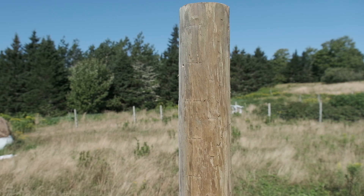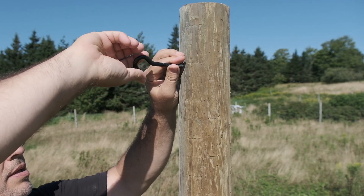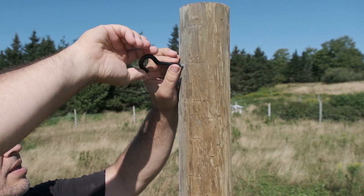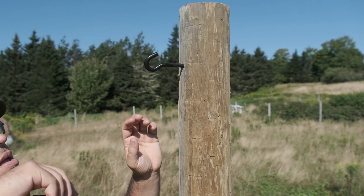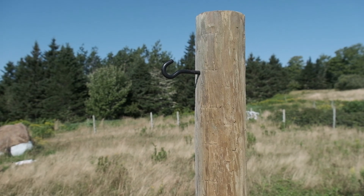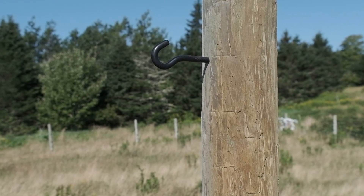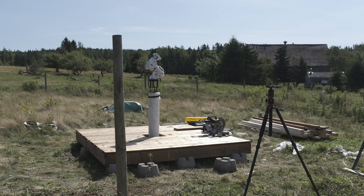This part of the job is simple: just drill a hole into the sides of these 10-foot poles, which are dug into the ground about 2.5 feet, and screw in some stainless steel rubber-treated hooks. While these poles are pressure-treated to resist the deleterious effects of all the humidity in Nova Scotia's air, the rubber on the hooks is very important to help stop moisture from getting into those holes and causing rot on the inside. Even so, I figured these poles should be good for at least 5, maybe 10 years. Their purpose is just to keep the extension cords high and dry off the ground, because Nova Scotia summer nights can become incredibly dewy, almost like a light rain, and their job is to keep the extension cords — particularly where they come together — high and dry, above that damp surface.